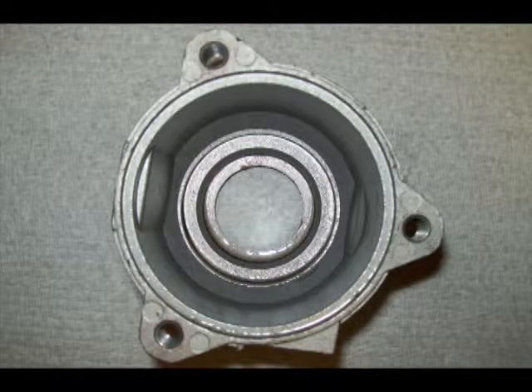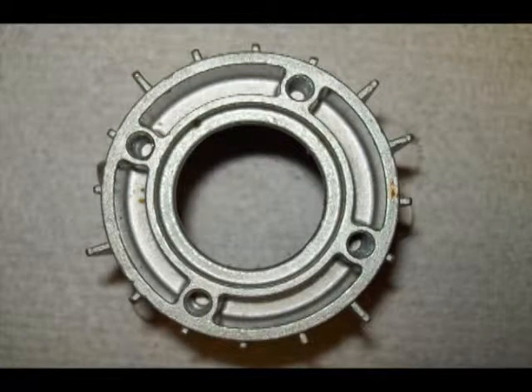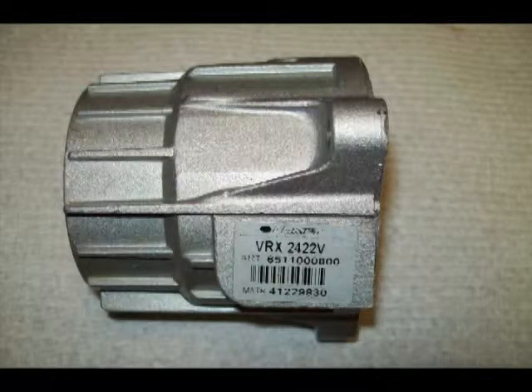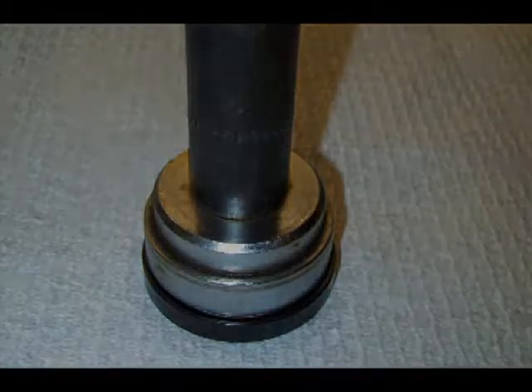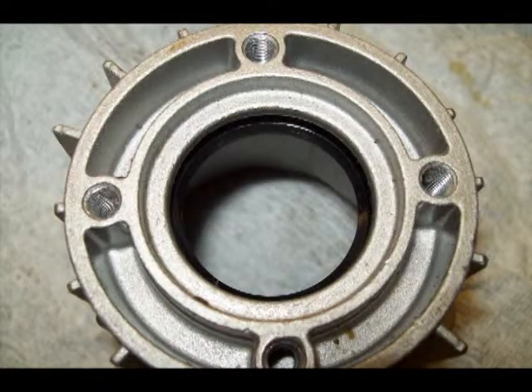This photo is looking down into the pump housing where the oil goes. The seal goes at the very bottom of this housing as shown in this photo. This is a photo of the top of the housing. The pump housing and oil reservoir is shown here on its side. You must have a seal driver to drive this seal in without damage. In some cases you can take a socket and turn it around on an extension and use it as a seal driver. And this shows the seal installed. Always lubricate a new seal.